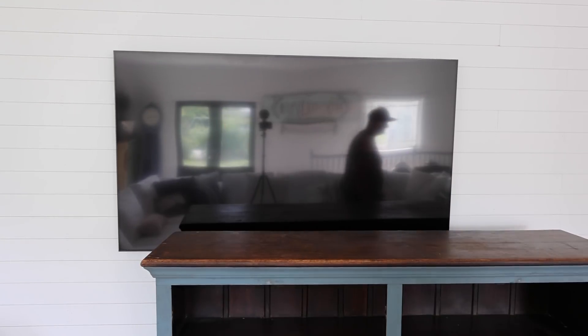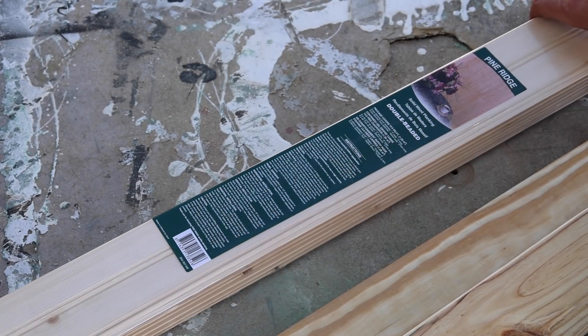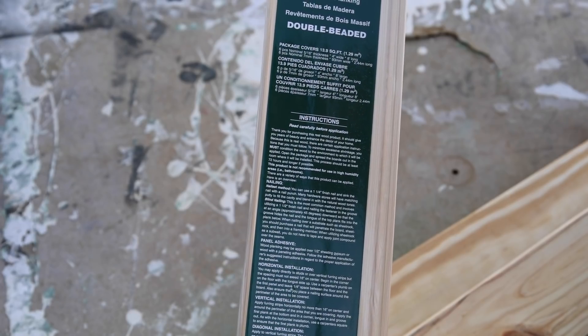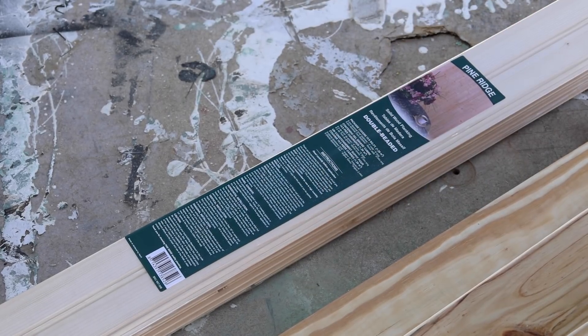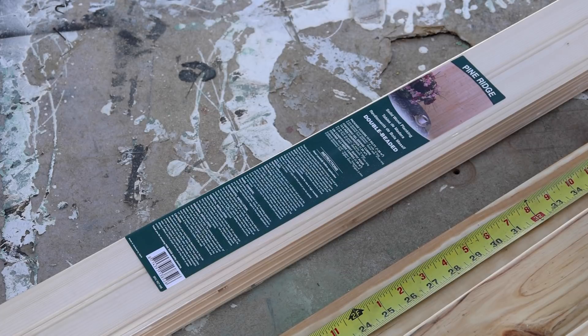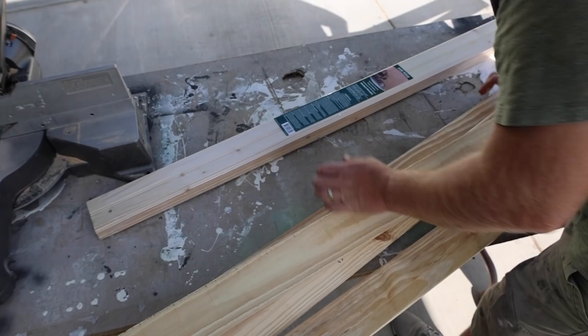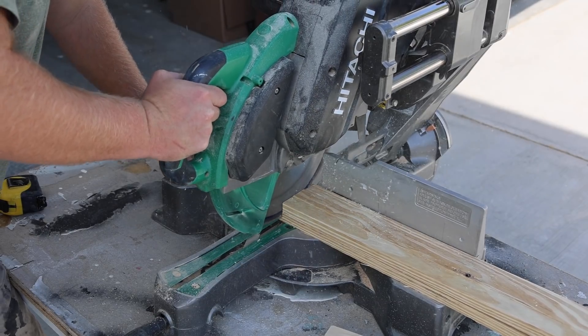You can drill holes underneath too — you probably should. The last time I did this, I had salvage wood about the right length. I don't have that this time around, so I'm using bead board — essentially double beaded pine. I'm going to add three inches on each side to those lengths, so 72 becomes 78, and with three inches on each side for the frame height, I go to 47. So 78 and 47 are where I need the corners of my miters. I'm using 1x4s for the interior of the frame — this is what goes up against the wall.